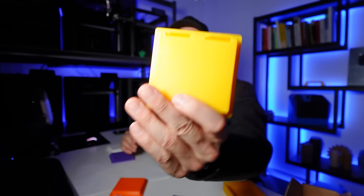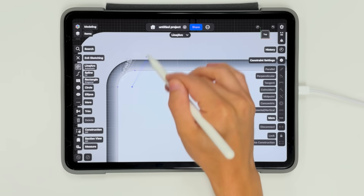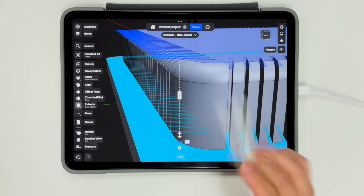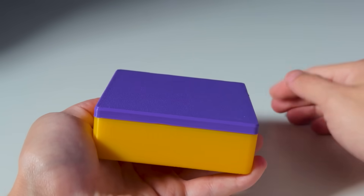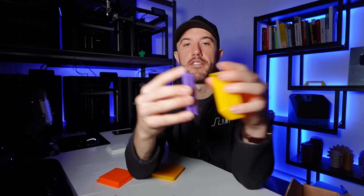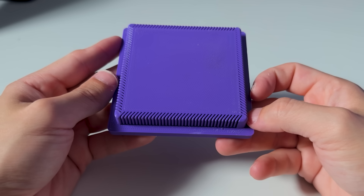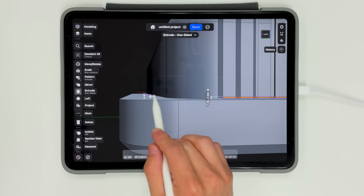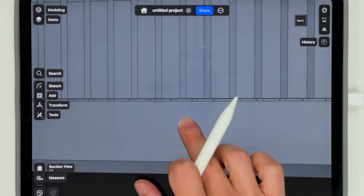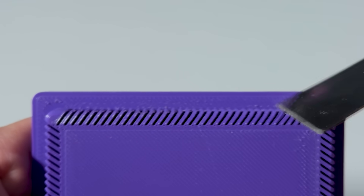You can take it even further with grip fins. The problem with individual springs is that one could break off, so grip fins give you redundancy. You take that little flange all the way around and make the entire outer walls larger than the hole itself. These can be a great way to get a really nice tight fit but still have enough compliance to be removable. You can make the fins longer for a softer touch or vary their thickness — all the things you'd do with springs. The trick is making sure you do a cutout along the bottom so they can flex freely. We recommend putting a 0.3mm space between the bottom of the fin and the bottom of the part so they can break loose and act just the way you want.